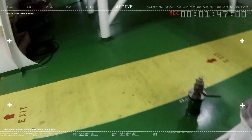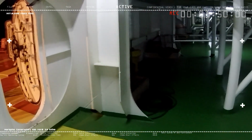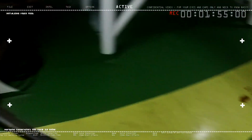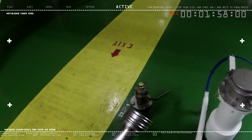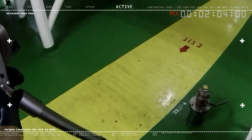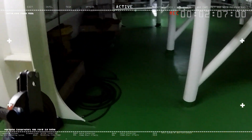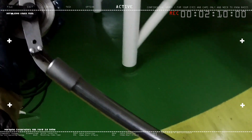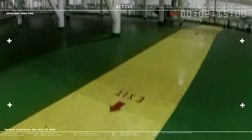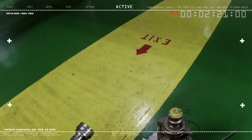We usually use the dipstick mostly during discharge operation, where we have to know how much cargo is left in the tank. That's why we use a dipstick, because sometimes if we use the UTI, it isn't exactly efficient, and at the same time, the sensors of the UTI are too sensitive that it might cause problems. Now, on this ship, there are special markers here to find out which sounding pipes we are going to use for our dipsticks.